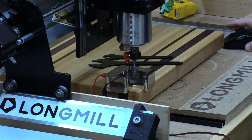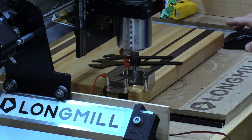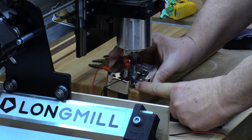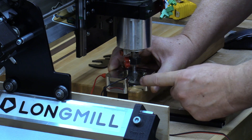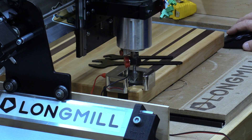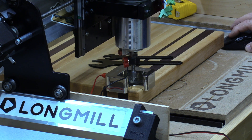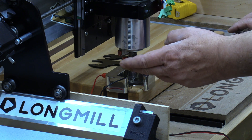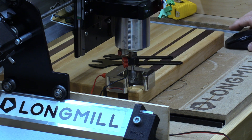Then we're going to get this thing positioned. I like to hand-screw it down just a little. You'll notice there's a square in the bottom of this — the tip needs to be in that square. It doesn't have to be perfectly centered. I'm going to move it just a touch towards the back and a little bit in X. Now I've got the magnet installed and we should be able to probe the X, Y, and Z.